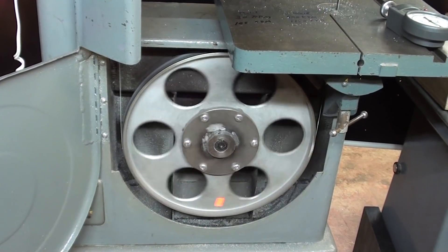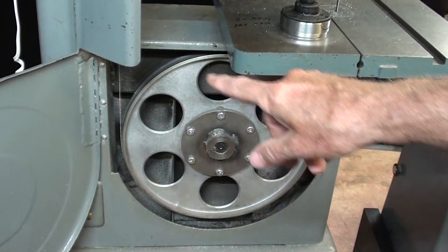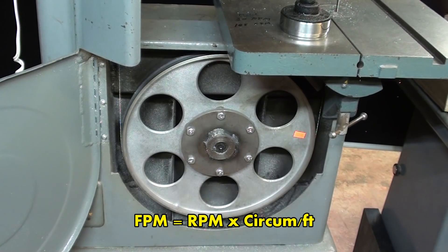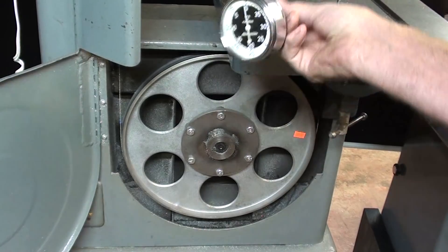That's another way of doing it — determining that's 30 RPM. So it's a simple formula to calculate it. We need the circumference of the wheel; that's a 14-inch wheel, but the circumference for the formula has to be in feet, not inches. The circumference of that wheel is 3.53 feet, and multiplied by the 30 RPM gives you 105 feet per minute. That's the way you can do it on your saw if you do not have instruments.